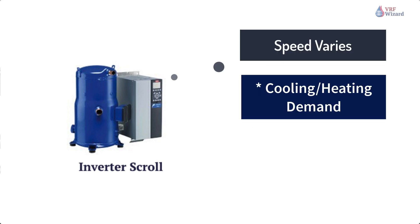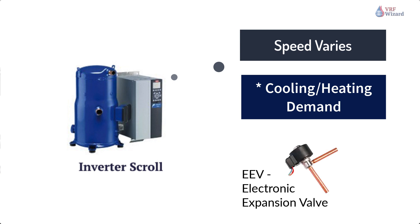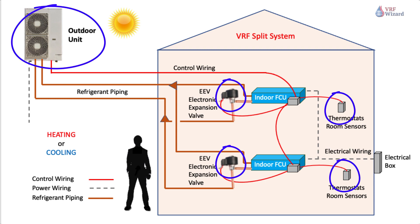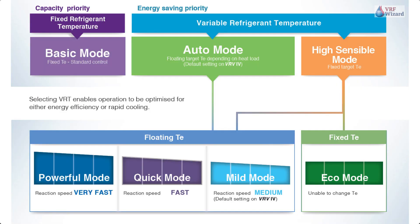The speed of the compressor will vary based on the cooling and heating demand from each indoor unit, which has an expansion valve regulating the flow of liquid refrigerant for cooling or hot gas vapor for heating. The pertinent information from the positions of the EEVs and the indoor sensors is communicated to the outdoor unit, which makes an adjustment to the volume of refrigerant flow and the speed of the outdoor fan required to meet the existing conditions. For digital scrolls, this would affect the loading or unloading cycle time. With the Daikin VRV4 system, you can choose the temperature response speed — very fast, fast, or medium — as the outdoor temperature increases and so does the evaporative temperature.